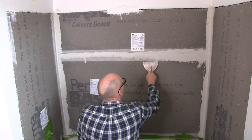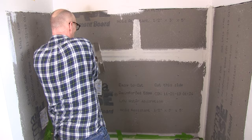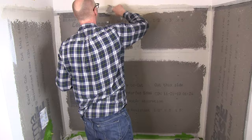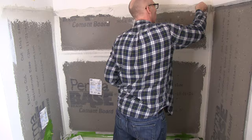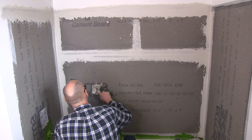So for peace of mind, I'm really trying to stuff the mortar into the joint behind the adhesive tape. Because the cement board is slightly thinner than the drywall, I'm using more thinset than what you would normally use to tape the joints where the drywall meets the cement board — this is so that I have more thinset to better feather the joint together. I'm also using cement board joint tape over any screw holes where I sunk the screw deeper than intended, just for peace of mind.